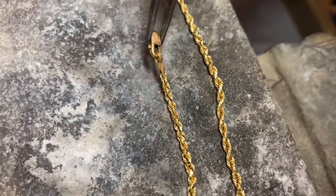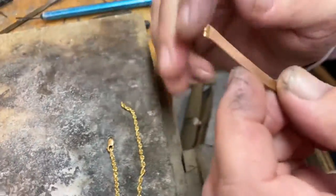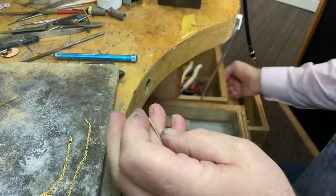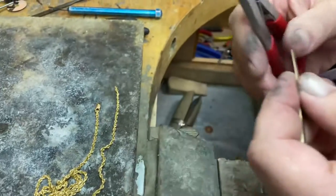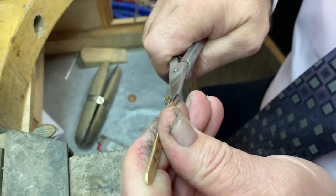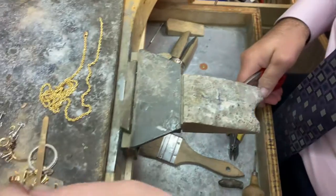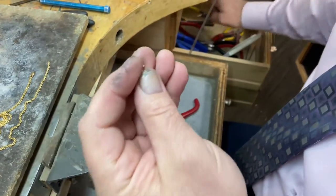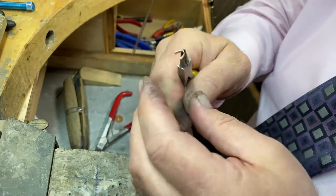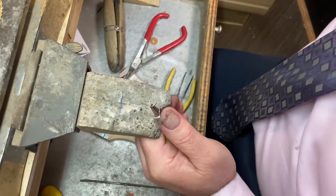So I rolled the piece here, I shined one part of the actual stock piece — something I roll — and then I'm going to cut it to size and grind it down to whatever we need. The reason I shine it on the inside is because it'll be very hard to get at it later, so you want a nice clean job. Even though when you heat it it might tarnish a little bit, if you dip it in alcohol and boric acid you should be okay.